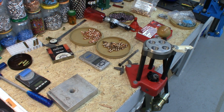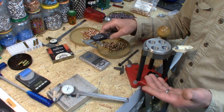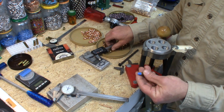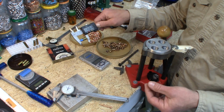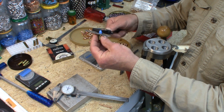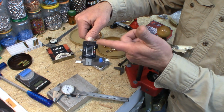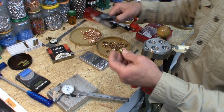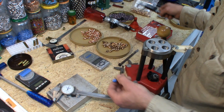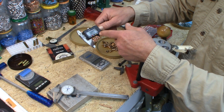The other items that you're going to need are some calipers, because you're going to need to measure some things, and you'll find out in the next video. You'll need to measure things like what is the overall length of that bullet. That's 1.131. You're going to need to know that. You might need to know the measurement on the mouth of the case. Mostly on 9mm, you're going to be measuring your overall length. So you need some calipers. And I suggest, I like these digital calipers the best.